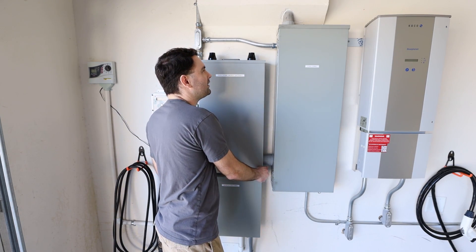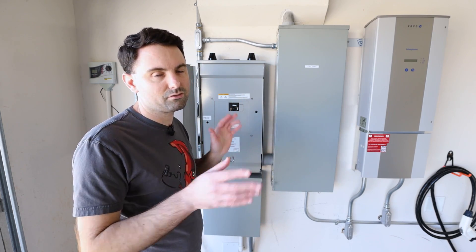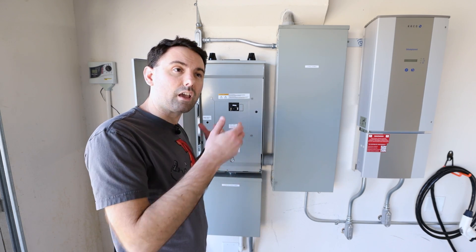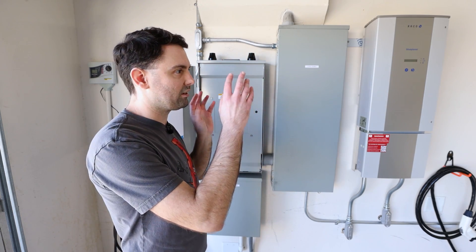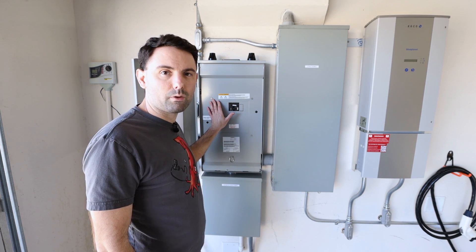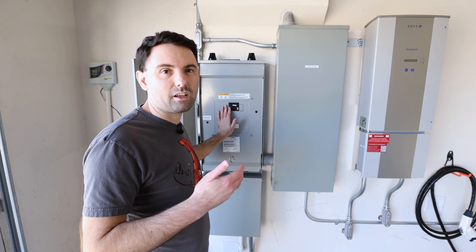Opening the box up, there's not really a lot to see in here because there's a big safety panel in the way. But you can see there's a 200 amp main in here, in addition to the 200 amp main outside — just because of my house configuration, a bit of redundancy here. In here are also all of the CT coils and electronics, which monitor the house's energy export to the grid, the amount of energy it pulls from the grid, the amount of energy being produced by the solar arrays, the state of charge of the batteries, and the energy flow through the batteries. All of that is monitored here and sent back to Tesla servers. It has both a cell radio, Wi-Fi, and hardware ethernet, so it has plenty of connection options.